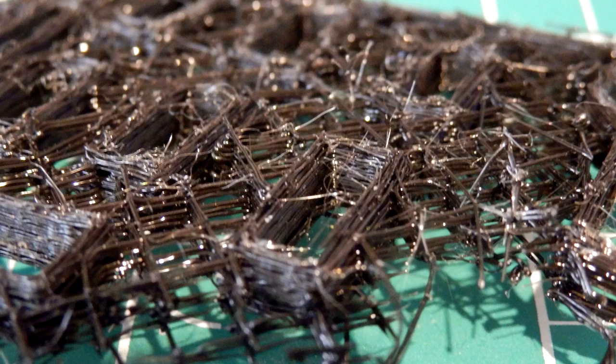Things to look out for if you suffer this: first of all it can often be temperature-related — the temperature of the hot end. What a lot of people do when they find this problem is they start increasing the motor current and giving the extruder more power to push the filament through, but actually it can be just that your temperature needs tweaking by a little bit.